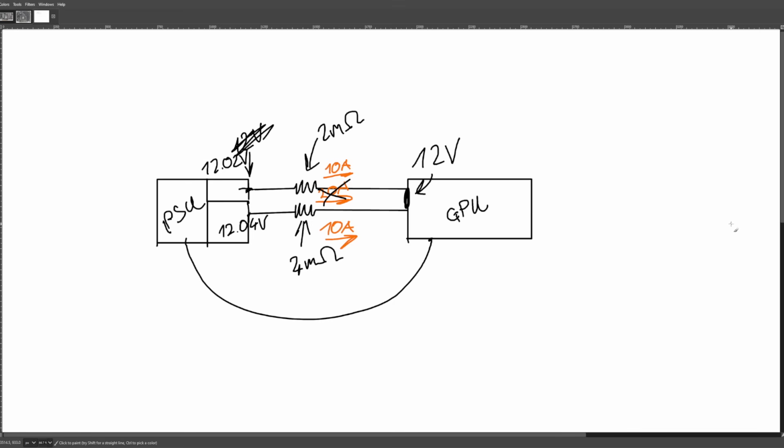So, yeah. Funnily enough, they did have all of that current balancing. Though I am convinced that all of that current balancing circuitry on old NVIDIA GPUs was a problem of NVIDIA's own creation. That wasn't like, oh, we're adhering to the spec. No, this is just like we've made a problem for ourselves and this is how we're solving it. AMD cards never bothered with that, and they still don't bother with that, even though they now have shunt resistors. So it's just, I don't know, NVIDIA things.